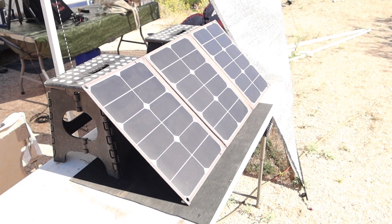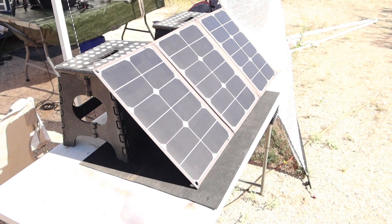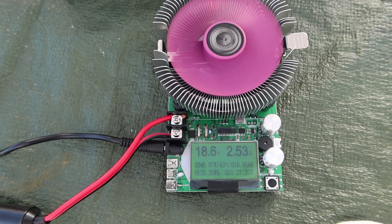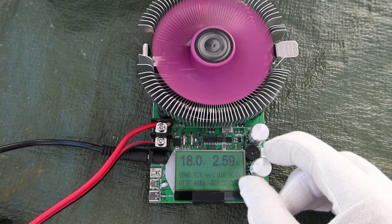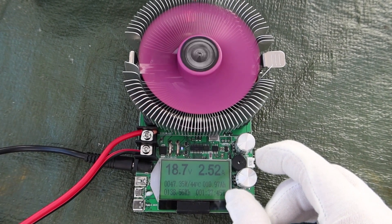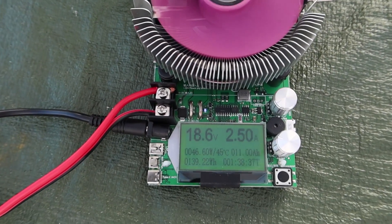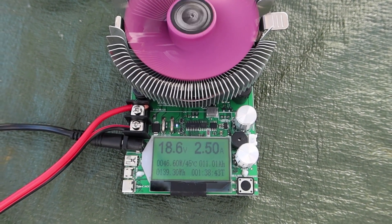Here is the old Solar Saga 60 — this one has four or five months of use and abuse. I used to keep this outside every day in the sun, in the rain, in the hail. I've dialed this in about the best I can and I'm getting about 47 to 48 watts. It's varying slightly. If I try to push it down to 18 volts it drops to 46 watts, but in the mid-18s it looks like it hits about 48. That's compared to the brand new panel which we saw got a solid 50 watts.